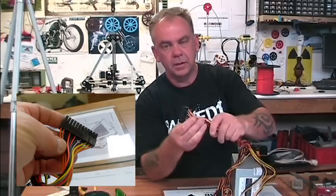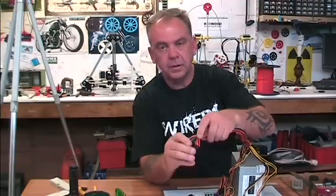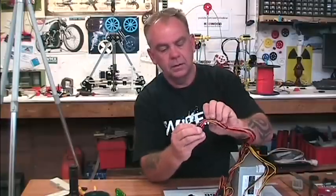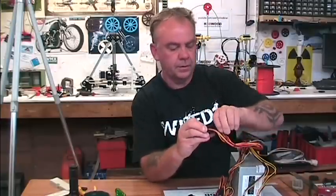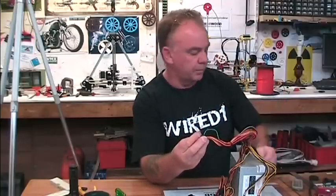This large connector has got the on/off switch for the controller, and that's the green wire you can see in here. We need to save the green wire — the way you turn these power supplies on is you connect the green wire to any black wire.